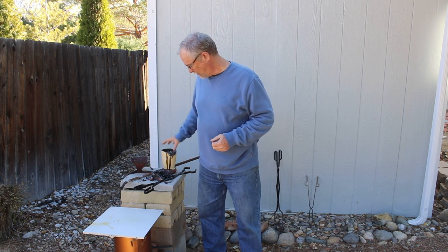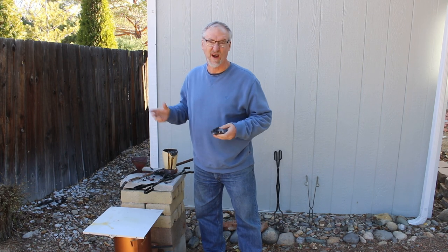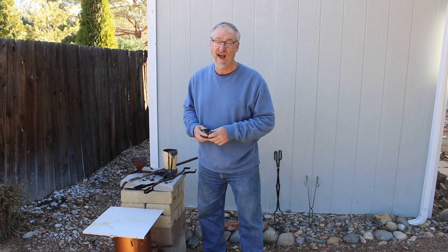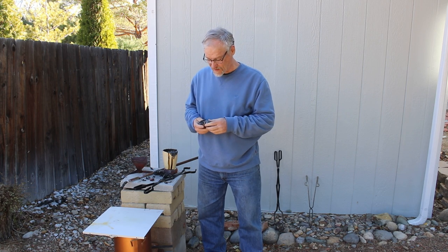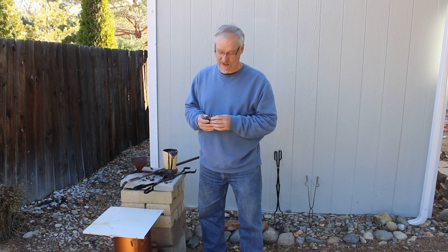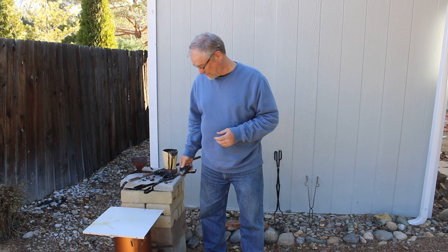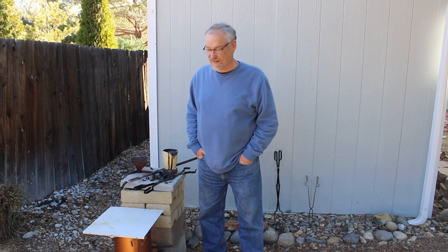So by the time it had cooled off enough that I could dump it out and check out what I got out of my melt yesterday, it was already really too dark to be filming, so today's the next day. Although there's a little tiny bit of copper in this, and I did get some copper out of it, for the most part what I got was a big old wad of matte at the bottom. A lot of copper there, but just can't seem to get it out.